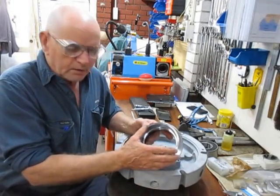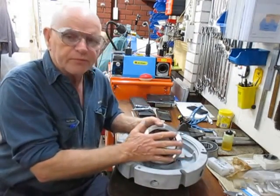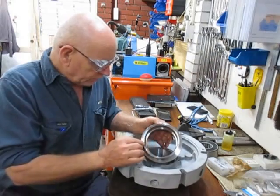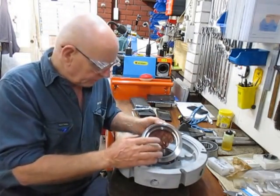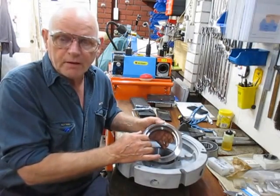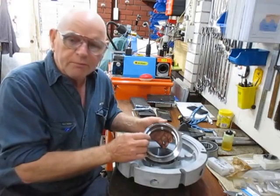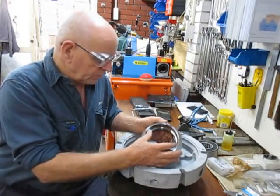...there's a change in the makeup and there needs to be relief from the stresses within it — it changes its shape fractionally. What I do is bore the internal bore to within a millimetre of my finished diameter, and machine all the outside out. At this point we're five millimetres above diameter on the OD and one millimetre below finished diameter on the ID.